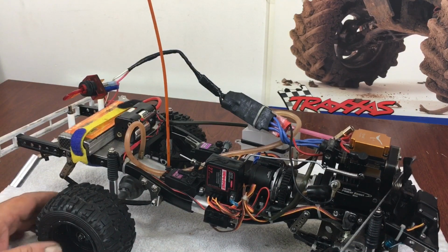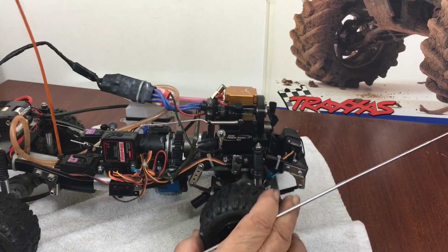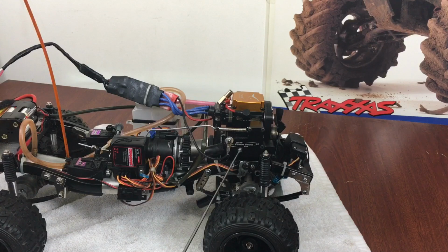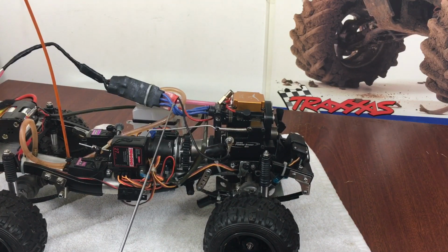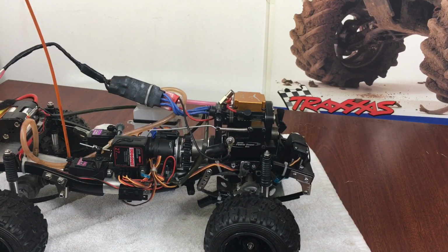So now getting to the motor on this thing, what I did was I experimented today, okay? Because it runs great when the glow plug's ignited and all that stuff, when you got power to it. When you shut power off, they do drop a little bit, but so did my RPM. And being that there's not a whole lot of RPM on this thing, I wanted it to have a nice clean rev all the way through. And when the switch is on and there's power to the glow plug, it has a nice clean rev.